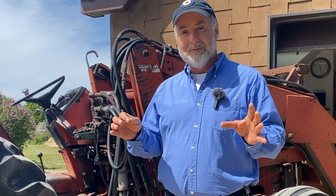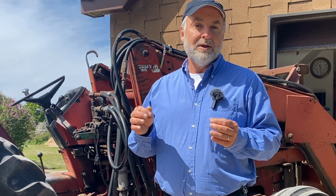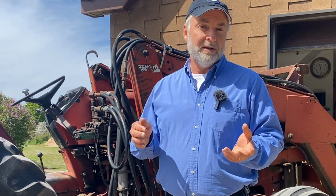If the nozzle tip becomes clogged or partially clogged when the engine gets fired up and pressure builds behind it, it can make the nozzle very difficult to remove for cleaning. So flush first, then install the nozzle tip of your choice after flushing and purging. This could save you considerable hassles.